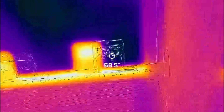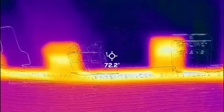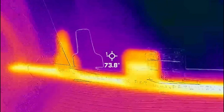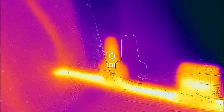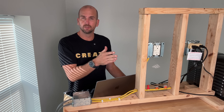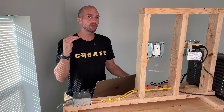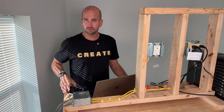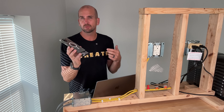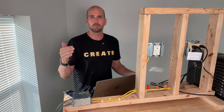After running for five minutes, the silhouette is a little offset from the heat signature, but we see about 116 degrees Fahrenheit at the Harbor Freight and a maximum around 112 for the WAGO. The wire nut is coming in around 102. There are five separate intervals of five minutes each, so I ran for 25 minutes total at that 30 amps or a little bit above. I used a FLIR thermal imaging camera that you plug into an Android or iPhone — super handy to get the heat signatures — and recorded the maximum temperature for each wire connector.